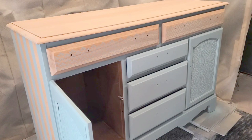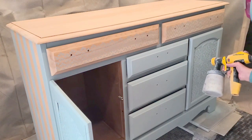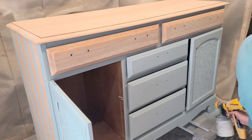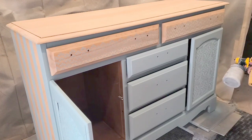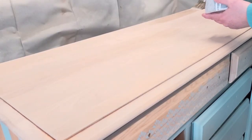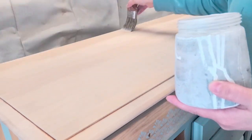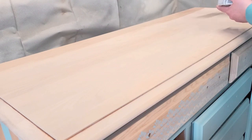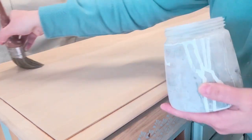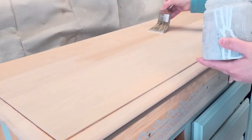Once all that was done, the piece was ready to be top-coated. I'm using cottage paint varnish in my sprayer — I said Country Chic clear coat, but it's actually cottage paint varnish that was already in the sprayer. I find that brushing the top coat on gives a nicer sheen and more shine, and I prefer brushing it onto the raw wood because when spraying, the wood seems to soak it up and doesn't give the same shine.